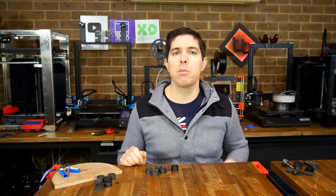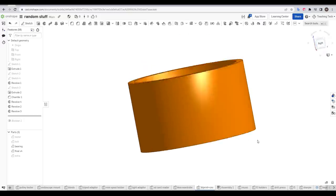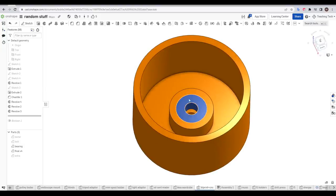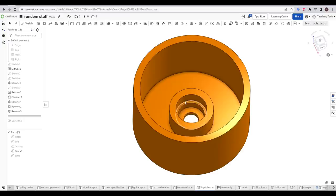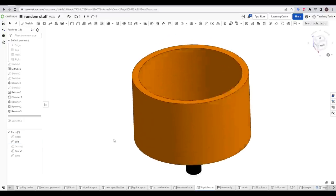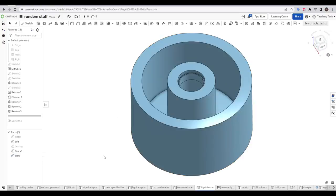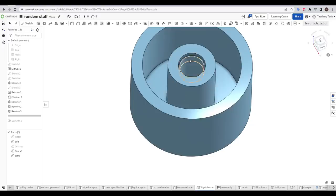So PETG is emerging as the dark horse, and it's time to produce the final design and to prep the CNC mill. Here is my wheel — it's quite simplified compared to an F1 in Schools design, but suitable for this test. This blue section is a bearing with a 3mm bore, used in the wheels to minimise rolling resistance. I have a 7mm wide pocket where I want to test how snugly the bearing fits, and underneath that is a space for a bolt to hold the wheel down when it's being machined. The whole point is to have oversized geometry so we can mill back to our chosen shape. The centre bore should be just big enough for our bolt to slide through, and there's a little lip to centre the CNC end mill and help us zero the machine.